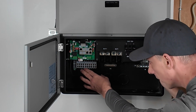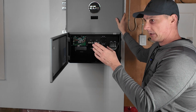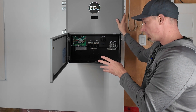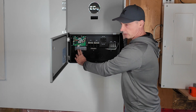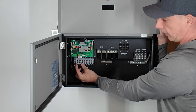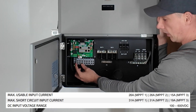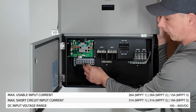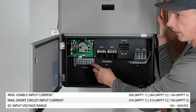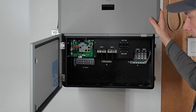The PV hookup lets you string panels together inside the unit instead of using a combiner box outside. I'd personally use a combiner box outside to keep fewer conductors traveling into the house, but you can run two strings and have them parallel-connect here. The first four terminals — two positives, two negatives — can handle 26 amps up to 600 volts. The second bank is the same: two strings up to 26 amps at 600 volts. The third input handles one positive and one negative for PV number three, up to 15 amps at 600 volts.